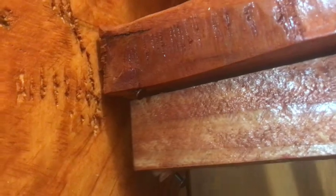I ended up with 9 stairs. You can cut the boards to length and then nail them in from the side into the stringers, and also toenail some nails in underneath as well. Underneath each step, I put a 2x4 support on the back of the piece, which makes it even stronger and able to hold more weight.